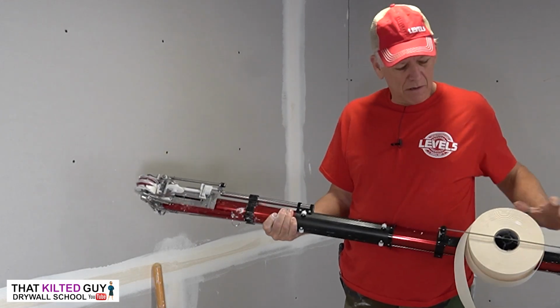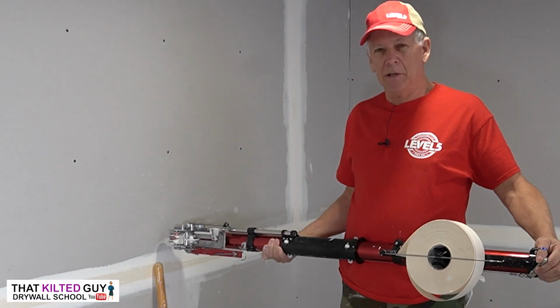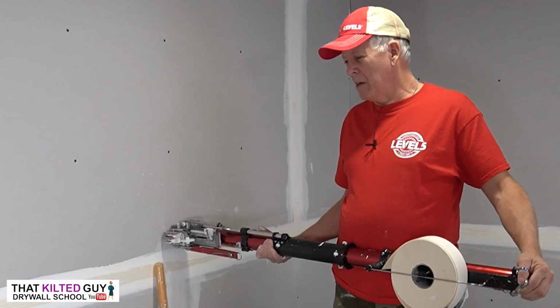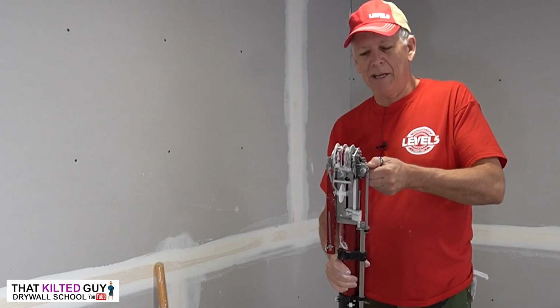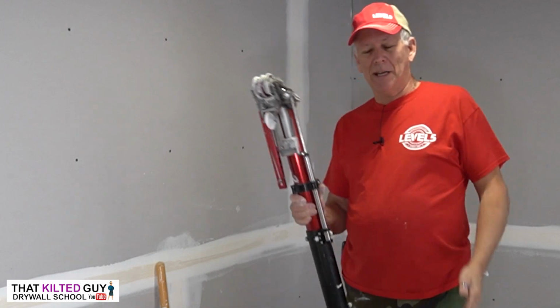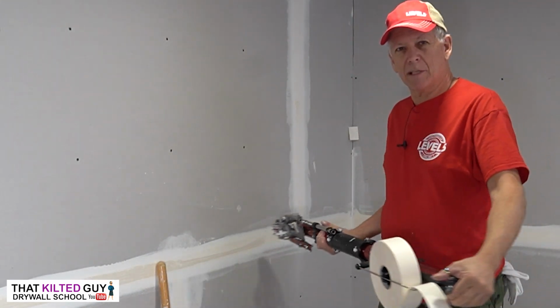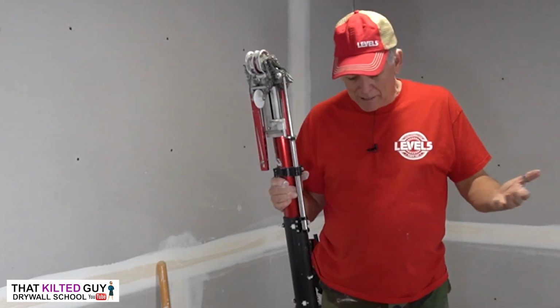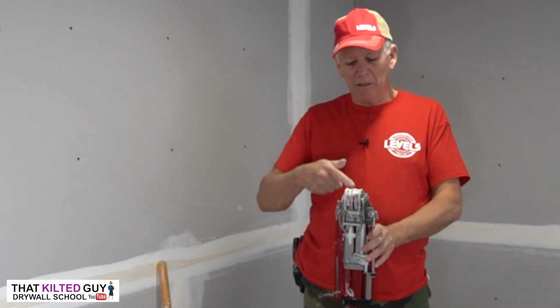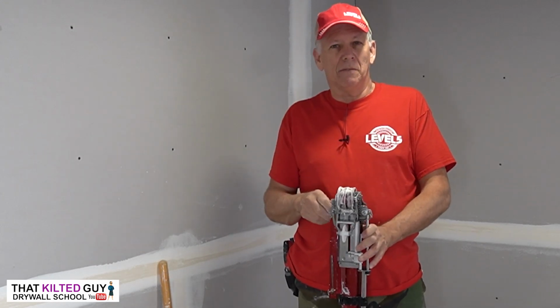Take the taper or paper out, and you put it on a piece of sheetrock, or you can stand here and turn it by hand, but you just turn this and pump all the mud out basically. So you could just run it across multiple times on that sheetrock, a pallet outside, whatever works. Get all the mud out, get it to disengage, then hose it off really well.